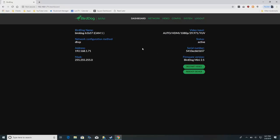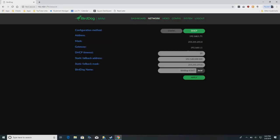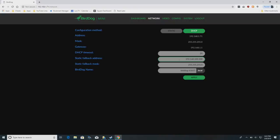Let's take a quick look at the control panel for the BirdDog. It's a simple device so the controls are pretty simple. On the front screen you've got all the information you might need, including what video mode it's currently set at — we're at 1080p 30 frames per second along with the color space. You can restart the video, reboot the device, and over in network settings you can see we're set to DHCP. You can also set a static fallback address so that if it doesn't get an IP in the field, you'll know its address. You can also set a local DNS name so you can connect just by typing an address into your web browser.